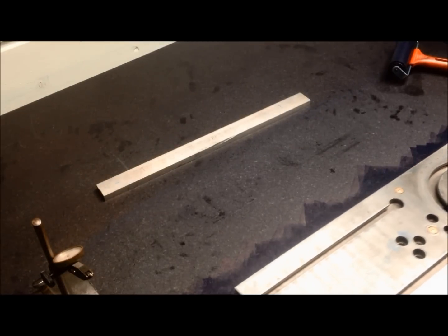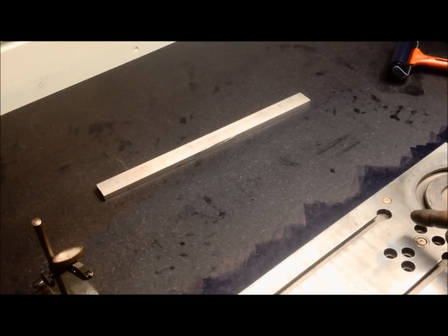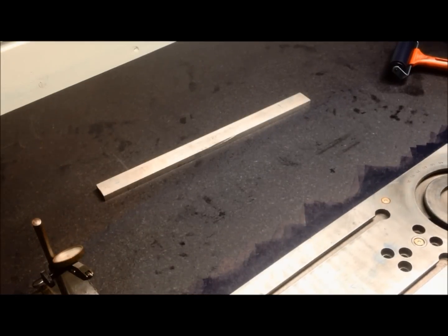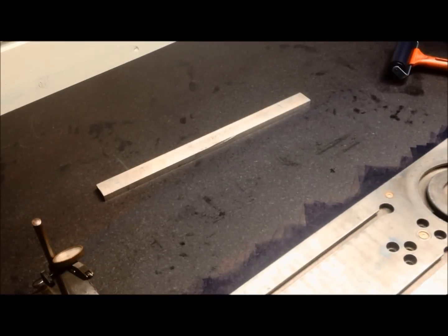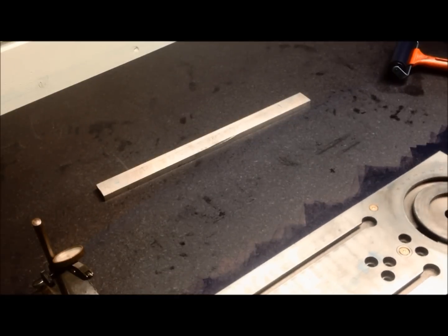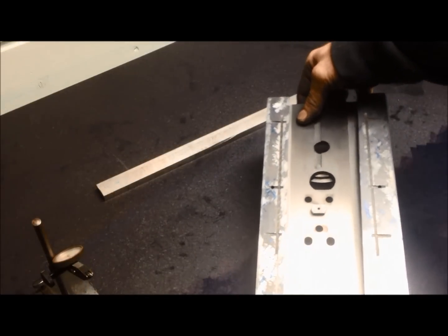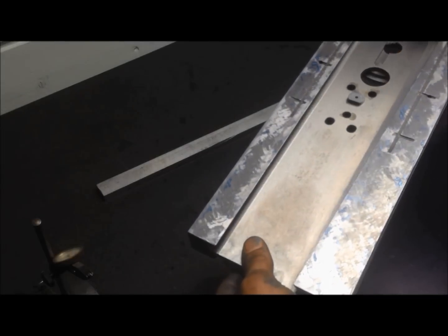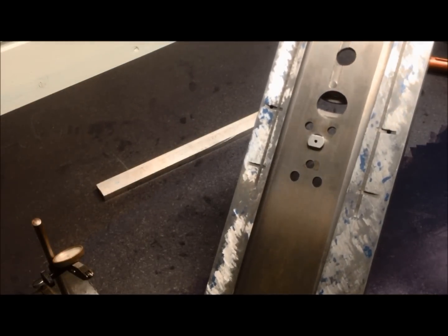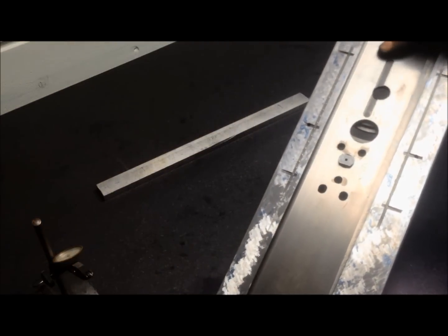Okay. Hinges okay. Quite okay. Beginning to get sticky, a little bit less blue also. See, there is some blue all over, so it's flat. So of course, there's a way to go before it has the contact bearing we want, but it's improving.